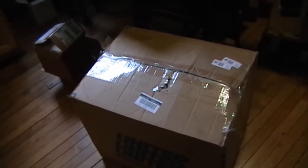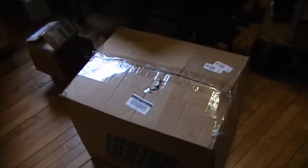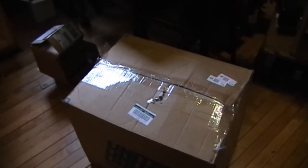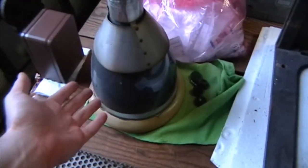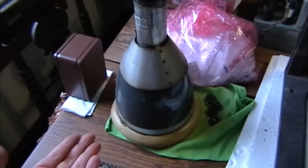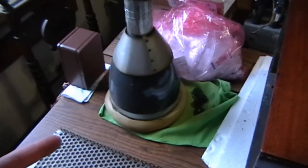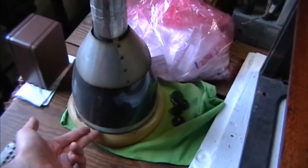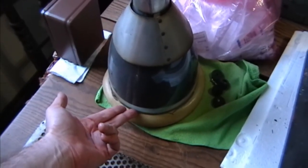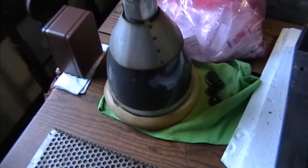The way you should ship a picture tube — or a scope CRT — is to have the face pointing straight up. But pretty much every picture tube I've ever had shipped to me has the face pointing straight down, and it's understandable since that's the most stable position with the heavy, widest part down. The reason this is a bad idea, especially when shipping, is if there's any debris inside — and there often are a few little bits that fall off the filament — they fall right down onto the phosphor surface. If it's being shipped and vibrating, that can scratch up the phosphor and really mess up the front of the picture tube.